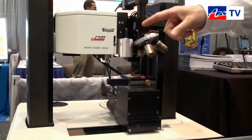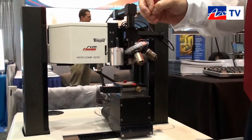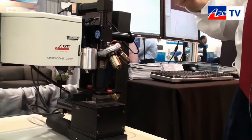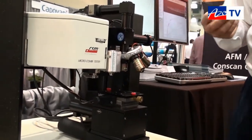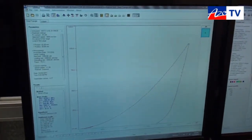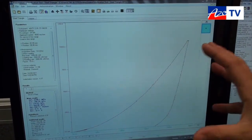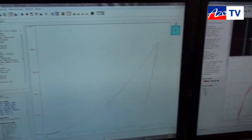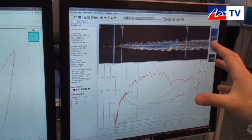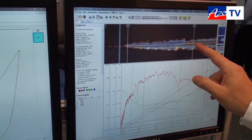What's particularly interesting about this combination of micro scratch and nano indentation is its use for very thin films and coatings. When you want to know coating properties, you want to know both the hardness and modulus, but also the adhesion and the scratch resistance. On these screens here you can see typical data from both heads. On the left we have a standard load-unload curve from instrumented indentation made by our micro indenter, and on the right a typical scratch test in our panoramic viewing mode, which is particularly useful for seeing where the failure points are — where you break through the coating and into the substrate.